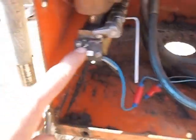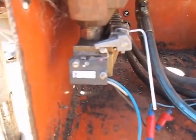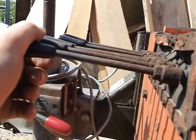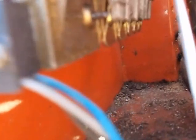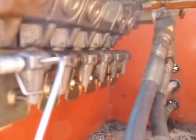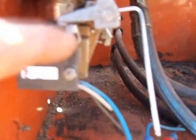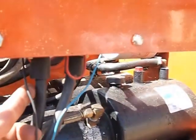That's a big switch that's actuated by a little micro switch here. You can see there's a little lever there. Basically whenever you operate any of these levers — apart from the log loader which I've purposely put out of action — you will make this little bar here move. The long bar with a load of little fingers on each of those valves moves one of the fingers, and then this end finger pushes down on the micro switch. Whenever that's pushed down, that feeds up to the solenoids and they fire up.